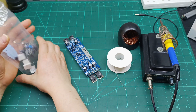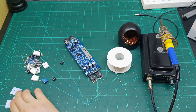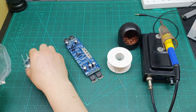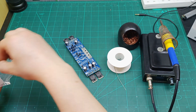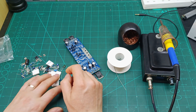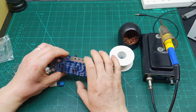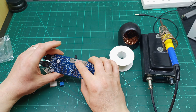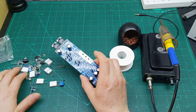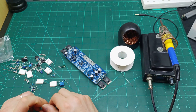I have this board and all the parts in the bag — isolating pads for the heat sinks, spacers, and other components. I'll put aside what I don't need right now. I'm going to start with these three transistors, bending and mounting them on the PCB heatsink area, then carry on with the small resistors. Let's fire up the soldering iron and start putting all the parts together.